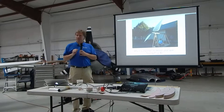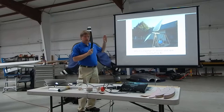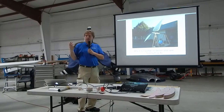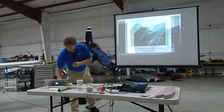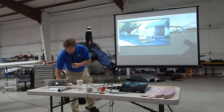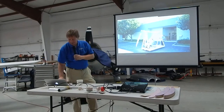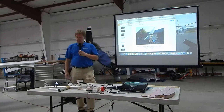This is a video showing why it's important to design your spar with spar caps in them. We were building our second propeller prototype, and the propeller spars are built very similarly — just smaller diameter — to the main spars. They have spar caps to resist bending, but they were late, and we wanted to build the propellers. So we bought some carbon fiber ski poles of the same size and shape and put them in, but they didn't have the spar caps. Here's what happened. In our defense, we were building this just for practice and weren't planning on using it in the airplane. This is the first time we put it under full power. Needless to say, we got the real engineered prop spars with the proper spar caps.